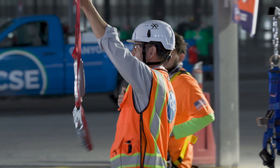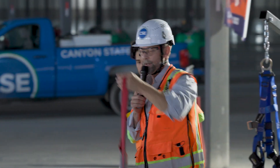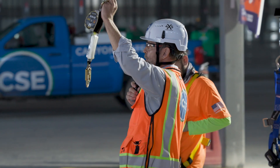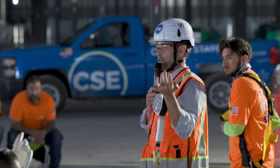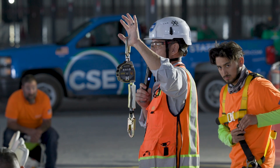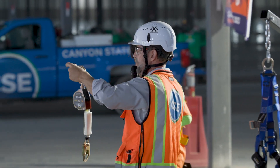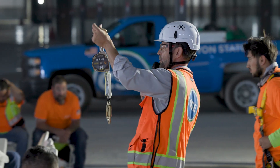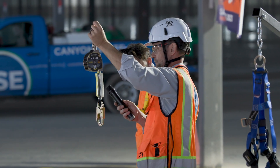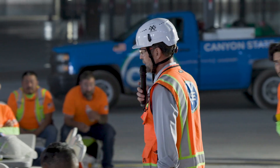What's this one? Lanyard. When can you use this on a Clayco construction job site? Never. These are not allowed. What do I have here? Yo-yo — also called a connector. When you put on your harness and your connectors in the morning, do you inspect them? Always. How do you inspect them? You pull it out nice and slow, inspecting the actual fibers, then check it like you would a seat belt — pull it, make sure it locks. If it doesn't, that thing needs to be taken out of commission.